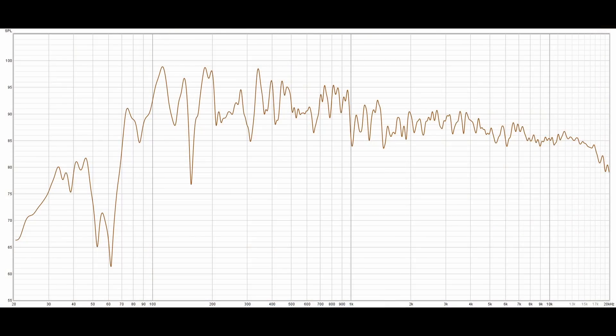I know that a good measure for speaker performance would be flat frequency response — something to shoot for, and certainly if you're building your own speakers that would be something to aim for. But whatever how flat they are, when you take those speakers and put them in your room, that all goes out the window. What you're looking at is the frequency response of the ELAC bookshelf speakers I used while setting up my listening room. I took measurements in a bunch of different locations and these speakers measure really flat, but when you put them in a room they're anything but flat. The room ruins that.